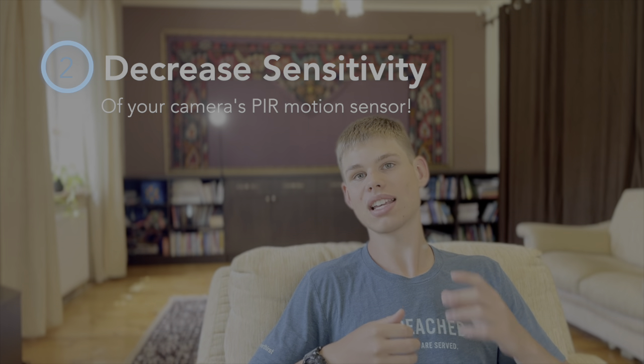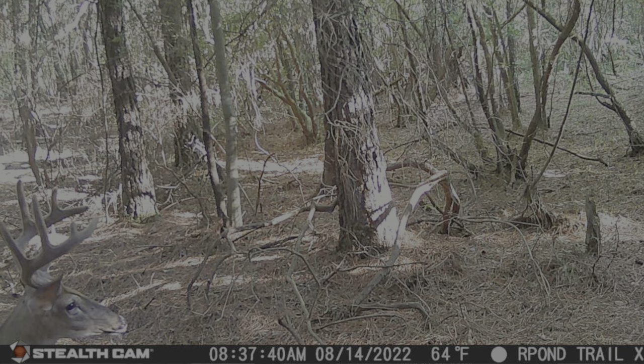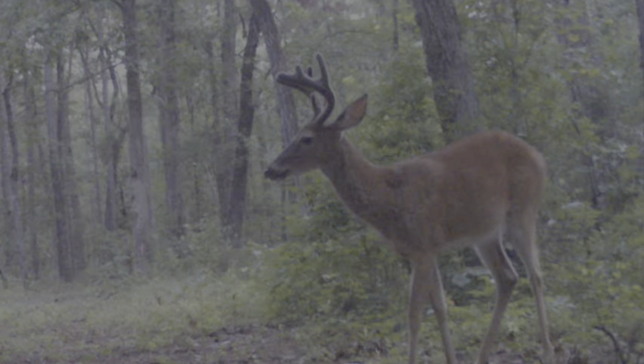On to our second tip to eliminate blank photos: decrease the sensitivity of your camera's PIR sensor. You may say you can't do that, that you'd have to take apart your whole camera or there's no setting for it. But I'm here to tell you, you can — it's easier than you think. This setting is actually disguised under another name in your camera's menu: the detection range setting. Not all cameras have this setting available, but if yours does, I'd give it serious thought to turning it down a bit during the summer months. While it is cool to capture pictures of deer 35 yards or so away from your camera, in most situations your camera should be hung so that deer are coming much closer than that. When your camera is set at a super far detection range, it has extremely high sensitivity to heat and movement. If you tune it down a bit lower, your camera will capture virtually no blanks whatsoever. Obviously there is compromise involved, but an SD card full of deer pictures is a whole lot better than an SD card full of blanks.